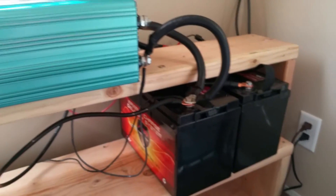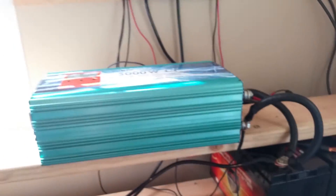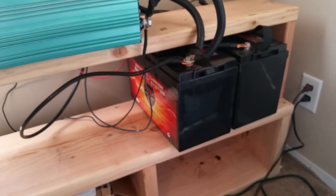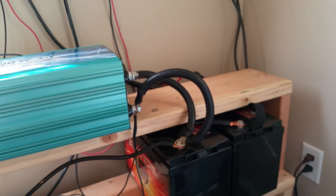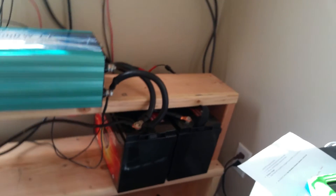I've got my two batteries — these are VMAX Tanks batteries, 125 amp hours each. They're solar batteries and they power the inverter. The battery stand I just built will hold eight batteries and also has compartment space underneath. I built the stand tall to shorten the wire lengths from the charging — the shorter the wires, the less resistance and the more voltage. These two batteries are really nice and identical.